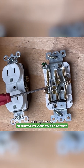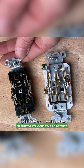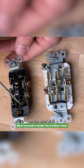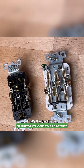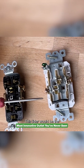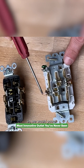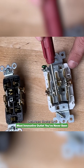Looking inside, I can right away say this is a unique outlet. I've opened quite a few residential and commercial grade outlets. My favorite commercial grade is the Legrand 15-amp — it has a traditional layout with two neutral slots on one side, two hot slots on the other, and a ground to the yoke. The Lightyear is the opposite of that. The hots are on the other side, and they're actually connected together internally via a soldered wire, meaning one hot conductor would power all four plug locations.